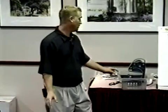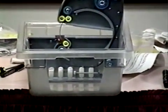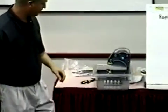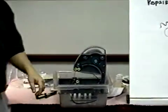To remove a belt, we're going to go down to the spring tensioner plate again and take it off of the pulley. You can always tell when it comes off of the pulley — it's really easy to find out. We're going to step on this cord as much as we can. Here's the easy part: you just unravel it off of the drive pulley and the upper pulleys there.